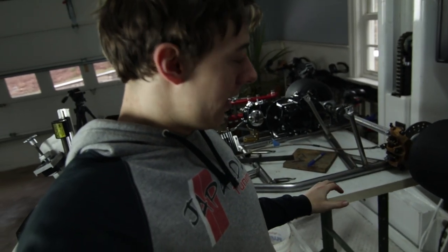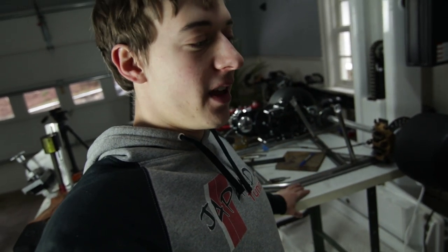So I'm working on this go-kart and I have the seat mounts all welded up, and then I just wanted to mock up the engine with the chain, but I realized I only have number 41 chain, not 40 chain, and this is running off of 40 chain. So I have to order that. So unfortunately, I'm not gonna be able to mount the engine today, but I'm just gonna try to figure out what else I can do before I mount the engine. Maybe I'll work on the engine wiring and get it to fire up and stuff like that, and mock up the shifting mechanism.